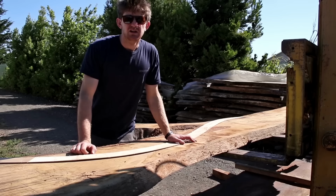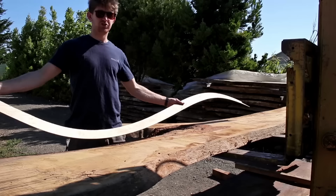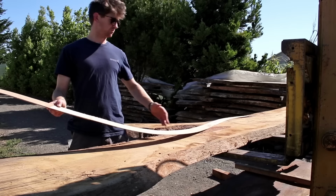So now I've got my template, I'm looking through my live oak stock and trying to find pieces which I can fit this template onto, which will make good futtock pieces for the frames. So generally with these frames in the middle of the boat where there's this big S-curve, I'm not going to get that whole length out of one piece of wood. But as these are double sawn frames, they usually have butts in them and they're usually offset.